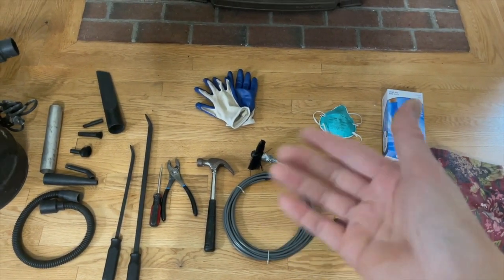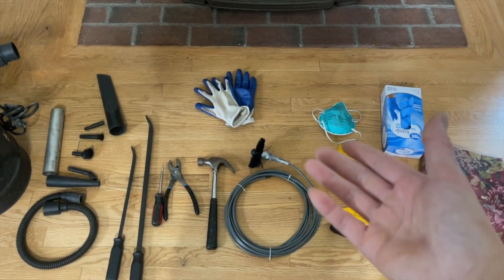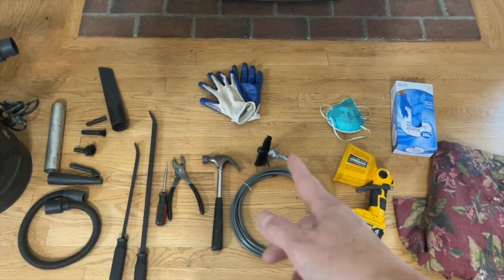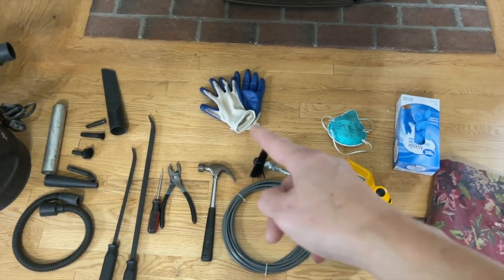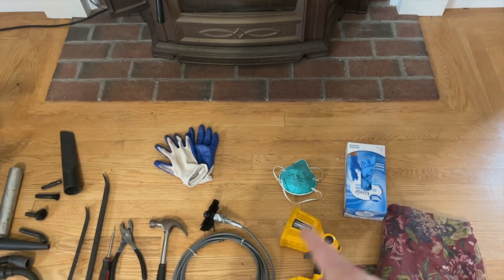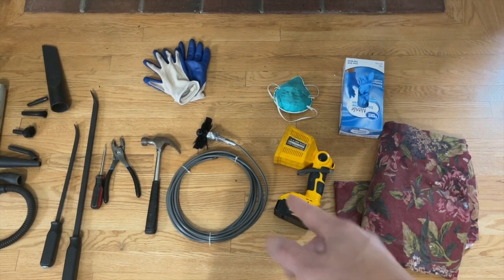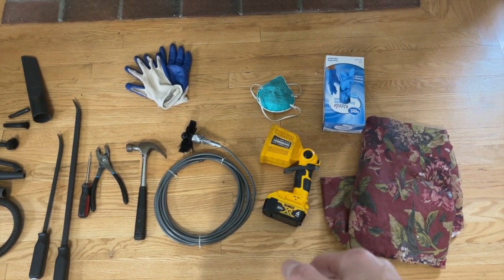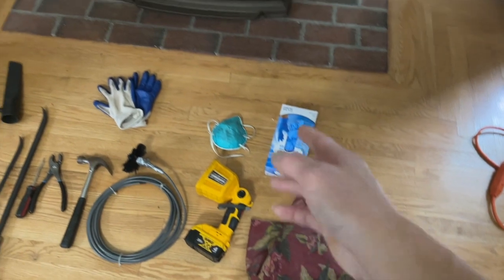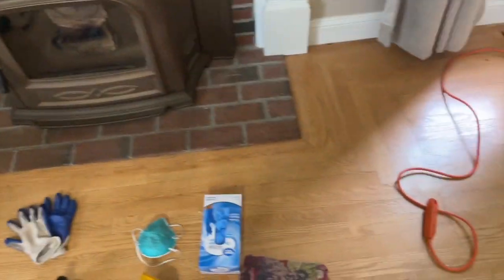I have a sponsorship from Amazon, so if you use any of the links below it helps support the channel. I also have a little chimney sweeper from Amazon — I duct tape it to make sure it doesn't fall out as I snake it all the way up. You'll need a pair of gloves, an N95 mask because it's going to blow out dust when you're cleaning, a DeWalt flashlight with very bright LEDs, and a drop cloth. I'm using an old tablecloth as a drop cloth so I don't scratch the floor when I drag the insert out.